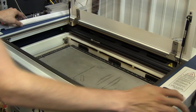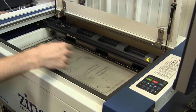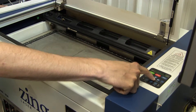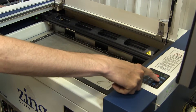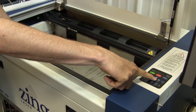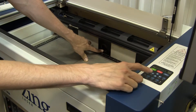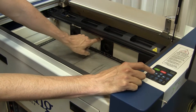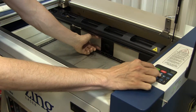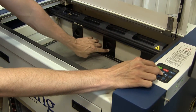Then on this keypad, press Focus. You'll see the gantry come out, then press Down to lower the table. Sometimes you need to press Focus again, then press Down to lower the table. You want to see these holes back here — you want the table to be about halfway between the top and the bottom of these holes, right about there, maybe about an inch below the hole back here.